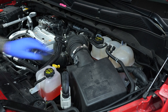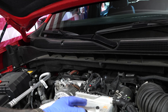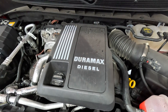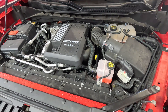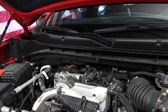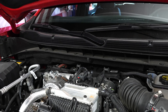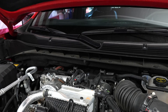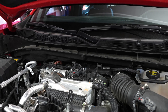Reinstall the 10 millimeter bolt on the coolant reservoir. Finalize by installing your engine cover — be sure to pop the clip in, put the oil cap on, and install the 10 millimeter bolt. Go ahead and fire it up. If you have any check engine lights, go over your work. If the check engine light continues and it's P0106 or related to the MAP sensor, go ahead and replace it or perform further diagnostics. Hopefully this helps someone who needed a little visual on it — this was merely to show where the MAP sensor is located and how I cleaned it off. Till next time, see ya.